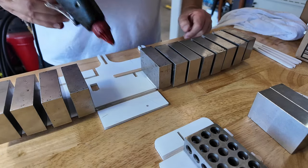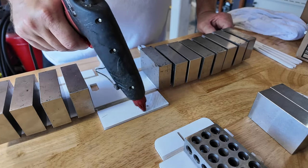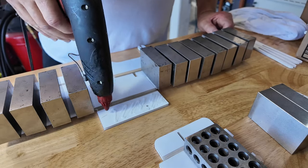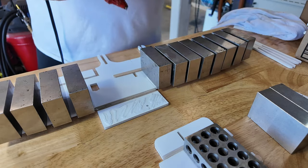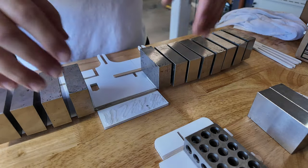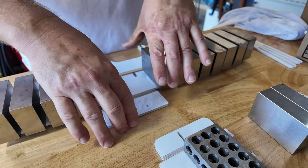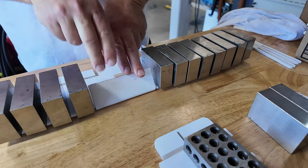Okay, these holes, center of gravity marks, just give you a tactile idea where to put your finger in order to get roughly a correct balance for this thing when you fly it. Again, I'm flying this on a 3S850. It's pretty tightly cowled. This is a sub 250 airplane, so it is going to be tight to run space. It'll accommodate that battery well.